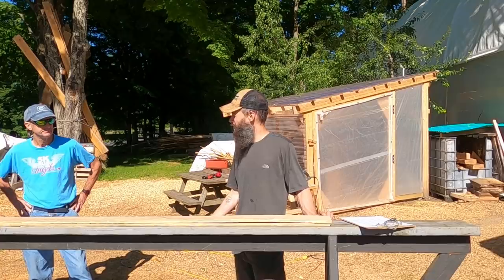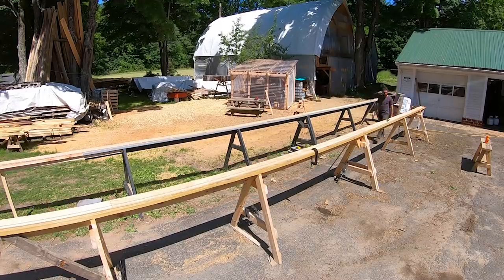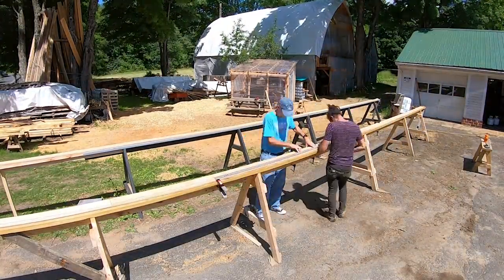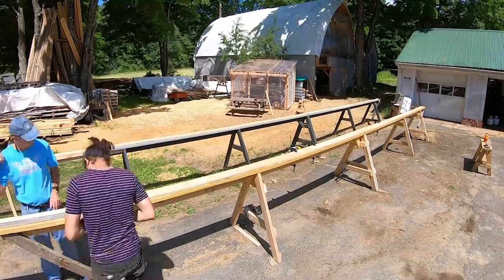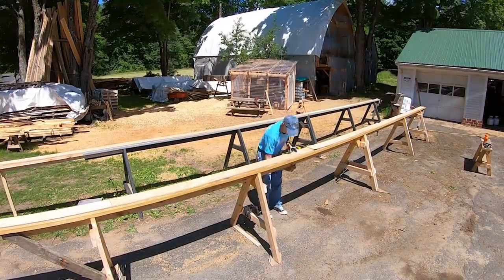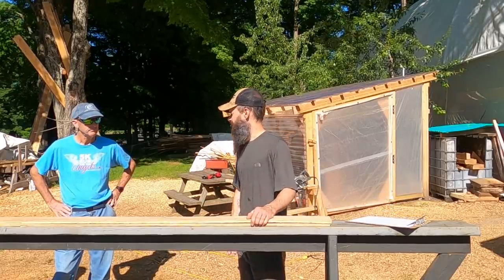And then the first step is gonna be to strike a perfectly straight edge on the bottom. So to do that, we'll grab a string, put a nail at either end, pull it super tight, go down it with the square, and then go down it with the long ruler and connect those. And then we gotta measure on the hull and find where all the stations land in the frames, and then we can lay that out on here and plot those points. And then once we have the two patterns ready, we can go pick the cedar and start scarfing them up.